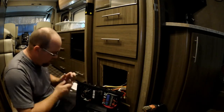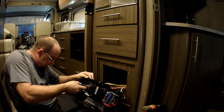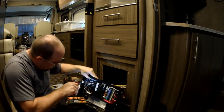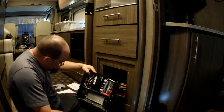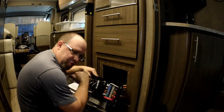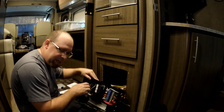The first thing I'm going to do is deal with this big orange lead back here — that is our primary 30-amp circuit coming into the control box. I'm going to disconnect it from the electrical panel so we can pull the wire out, then cut it, splice it into the surge protector, and from there wire everything up. I'm going to take it loose at the breaker, at the neutral bar, and at the ground bar. There's a black wire, a white wire, and a bare copper wire that comes in and ties into all this.